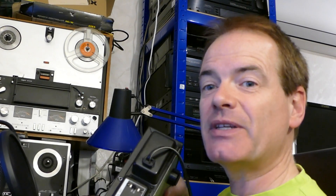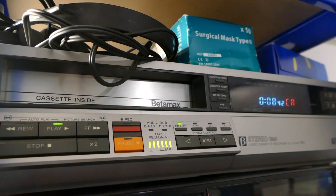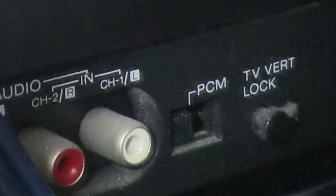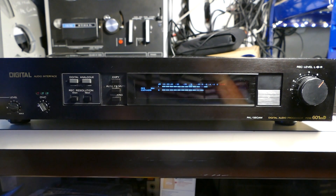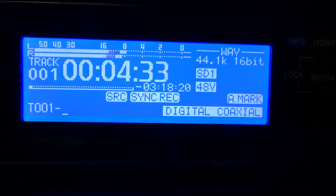This is the one with the digital inputs and outputs on the back — there's an SPDIF output, so we can connect that to a modern digital audio recorder and get a pure lossless copy of the tape contents. Let's put it through its paces. We'll play a test tape on the Sony SLC 9, chosen because it has a PCM switch at the back which disables the dropout compensator in the video recorder for the best error correction performance. This switch in certain Betamax models was probably the main reason Betamax was nearly always used for this format. We get a good tracking signal and good audio, and most importantly a pure lossless digital recording from the SPDIF output. For some inexplicable reason this feature can be switched off — the instructions don't explain why, but I'm guessing it's probably because of some possibility of digital noise appearing on the analog outputs.